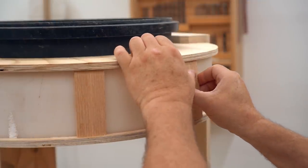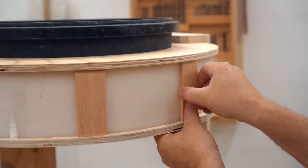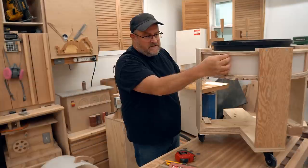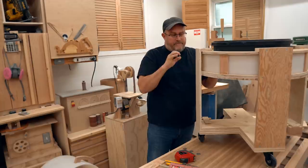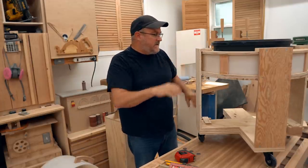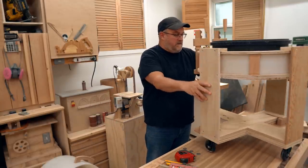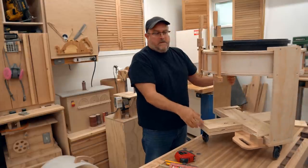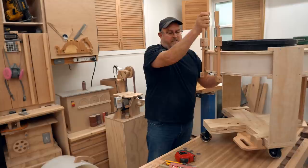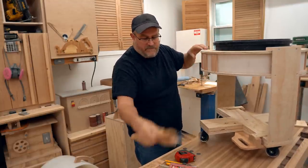I also had these things between the upper deck and the baffle — the edge of it — to glue those together. I used polyurethane construction adhesive to fasten those. I don't trust the bond that silicone has with the plastic, and I'd rather have something there just as insurance. That's the reason why these clamps are on the front here and I can't get the bucket in right now. Actually, I'll take those off — they've been on there for about an hour. You can see I just put three in down the front.